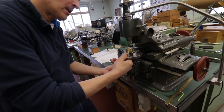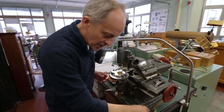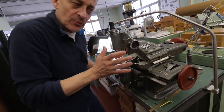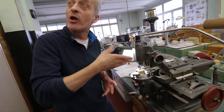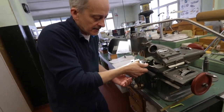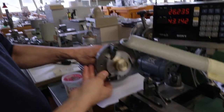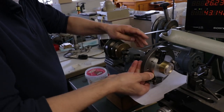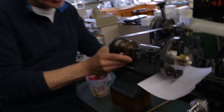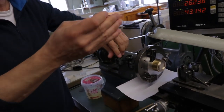And so then you center the workpiece. Yes, centering with the light, I have some tool to change the position, and after that I fix it completely. When it's turning perfectly at the center, I want to have the reference. I put it on the lathe, quite faster and easy. I put the reference of the position also, so it's always the same. I have it inside the 100. Wow, the precision.